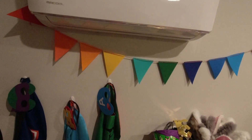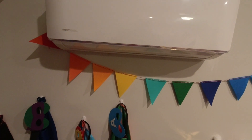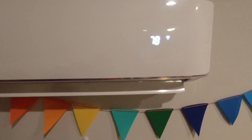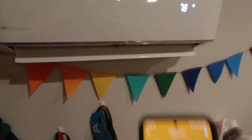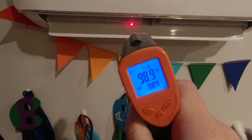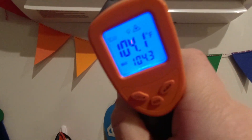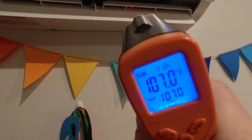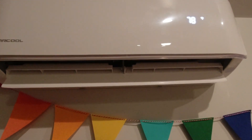Back up here — let's turn this back on. We're a little low on refrigerant still but I do think we're going to see good results. Switched to heat mode. I went ahead and cranked the temp up to 78; room temperature is reading 67. Putting the thermometer up here — it's still gaining speed: 95, 98. We're not even fully charged like we need to be, and we went from putting out room temperature air to now cooking. 107 degrees. Yeah, we're definitely good. You can hear now that the airflow coming out of here is much greater than it was previously, more akin to when we had the fan running.